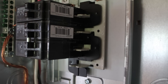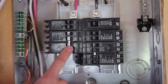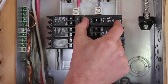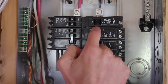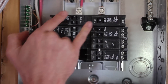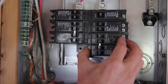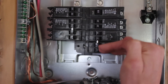We've got three physically different types of breakers but only two different capacities: 15 amps and 20 amps. The 20 amps are mostly for the kitchen counter plugs, and one outside plug, and the 15s are for everything else. This here is one breaker slot with a single 20 amp. Eaton, which is this brand, makes breakers where you can get two minis in a single slot, which allows you to have more circuits in the same number of slots. So we've got five 20 amp circuits — two minis and a single.